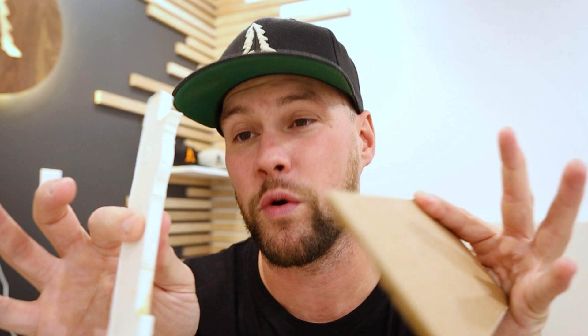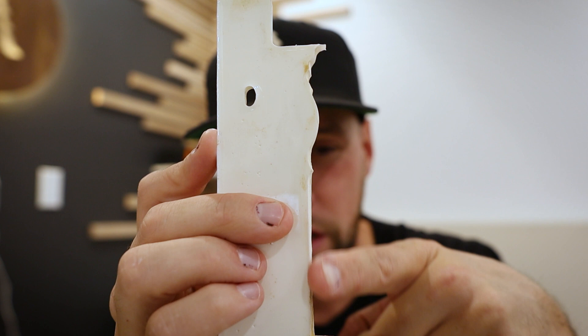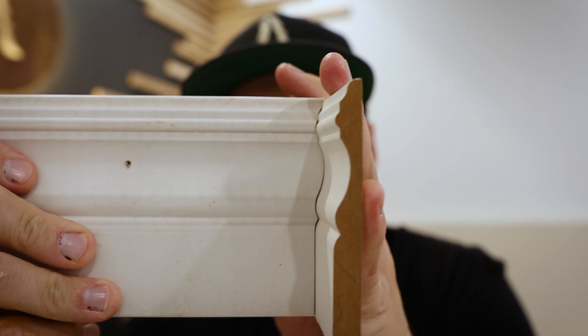But this is kind of what you can expect: you basically take your mold, pour in your piece, and once it dries it leaves you with a profile. You can use your router to cut things out and you're left with a cut piece that has the perfect profile. You can take that and put it on your piece and it leaves you with a nice clean seam. I don't know why I just did that whole speech because I can just go outside, get set up, and actually show you how it works.